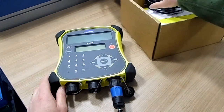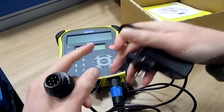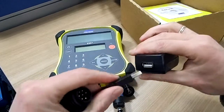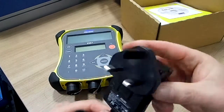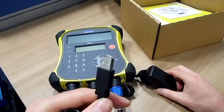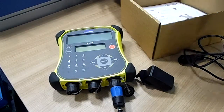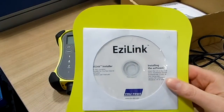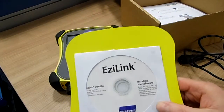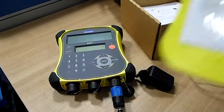So what else is in the box? We've got the centre cable for recharging, which terminates in a USB connector that just plugs into a power adapter so you can charge it up from the mains. This USB connection will also let you connect the box to a PC. TrueTest, if you're using this as a standalone system, will provide the Easy Link Windows program, which is very quick and simple to install. That will allow you to download all the stored weight sessions on the box onto your computer and save them as spreadsheet files.